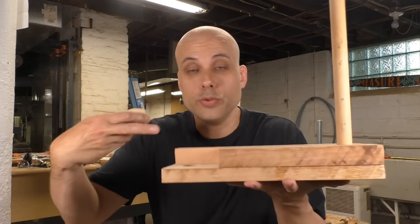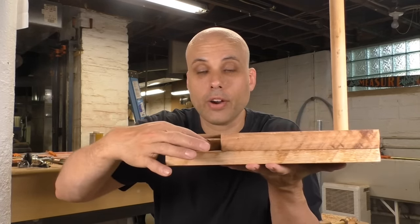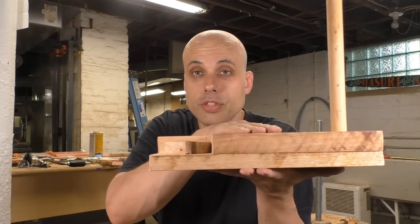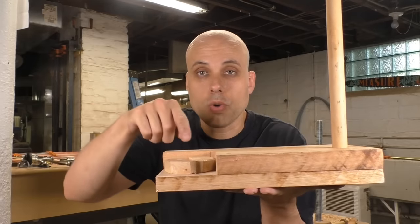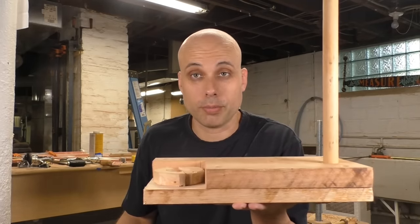What I'm going to do is assemble this around the vise screw and then put screws through the edge so that it clamps down on that screw with a tight friction fit. You could take something like this and epoxy it around the screw and that would be totally fine, but by putting it together with fasteners we're going to allow our vise to be easily disassembled if we ever need to change or repair anything. This is also why we used a thicker piece for part of the outer jaw — that way our keeper can sit in this recess and it's underneath the jaw, out of the way. As it rotates it's not going to rub against the work and it's not going to keep the vise from closing properly.